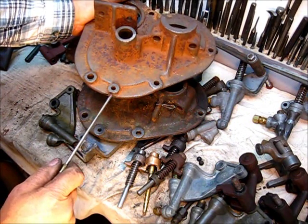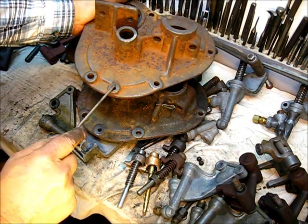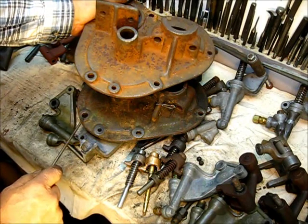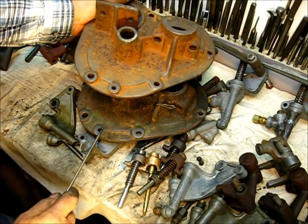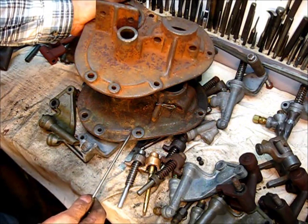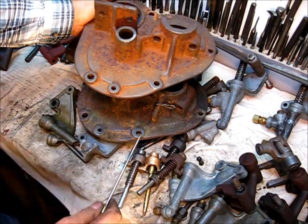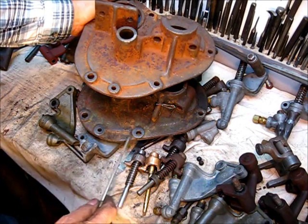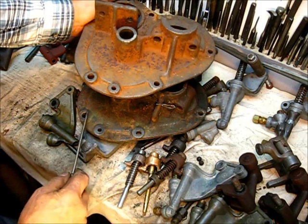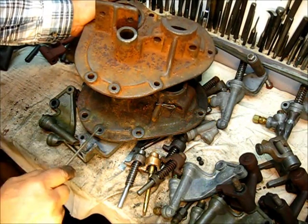On this old one you can see that they are not machined surfaces — those are as-cast, those three bosses. On this late model, this one back here was cast taller compared to this one, and then these are machined in a plane — all machined surfaces. This one in the middle is where the dowel pin goes.